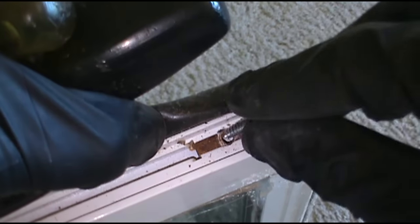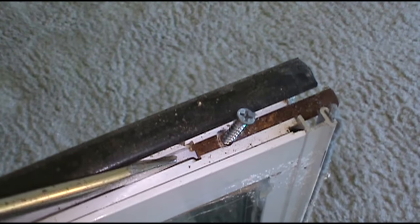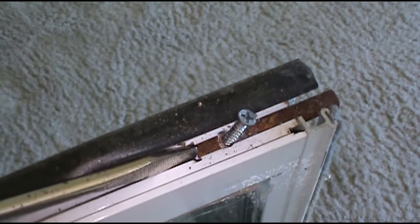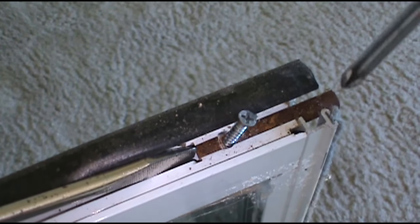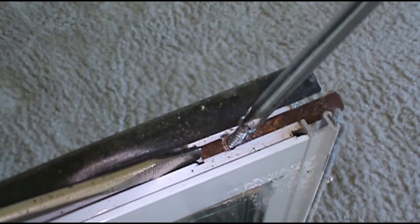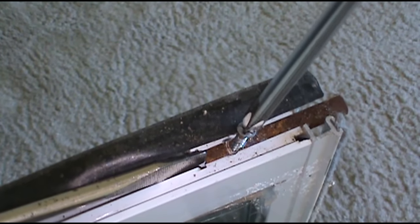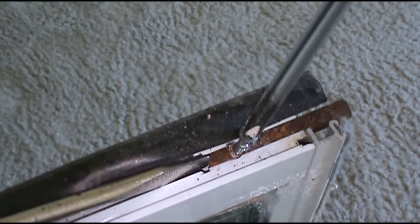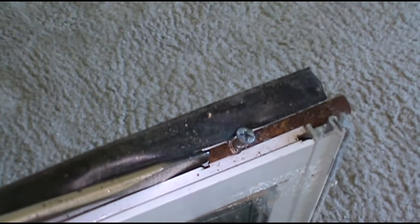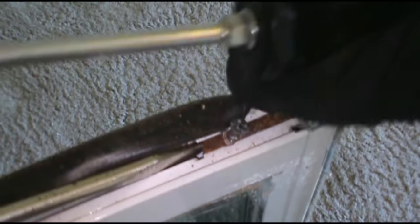After you bump it out a skeeter leg, you wanna bring the screw in at an angle. It's not gonna hurt anything. I've done hundreds of these windows, it feels like, since 2014. I've done it the same way and it's always worked. So I bring it in at an angle just to tighten this cleat down so you don't go over too far. So you can still see the screw hole, but you gotta come in at an angle.